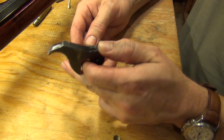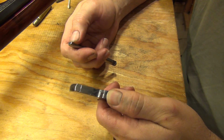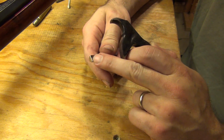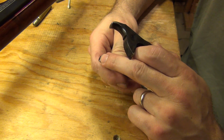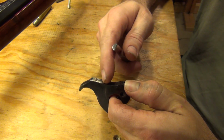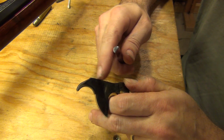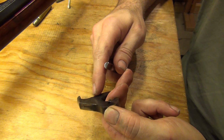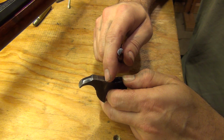I don't know how many times this rifle was cycled before I got it, and I'm sure I'd cycled it dry a few times before I worked on it, but very soon after I got this I started working on it, and you can see the back of this firing pin extension where it rides over the hammer. That's one of the things I did to try to smooth the action. That is a mirror polish, and this edge is broken very nicely. I'm going to carefully try to stone some of this. A little worried I'm going to take the case hardening off. I hope I don't, but if I do, the answer is going to be, well, I probably needed a new hammer anyway, considering the damage that was already here.